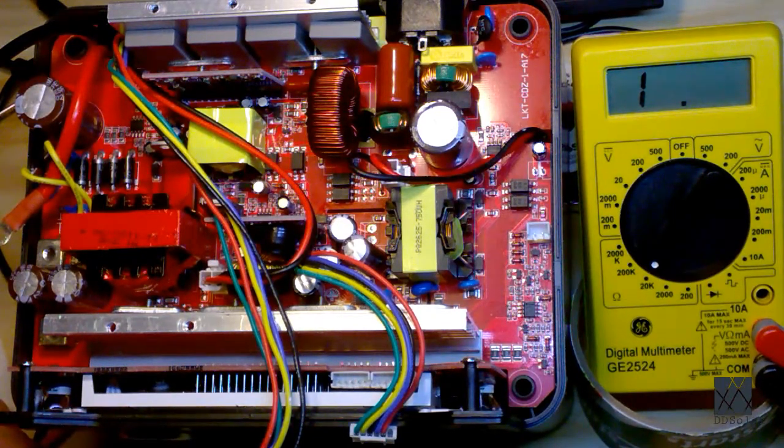So next I'm going to zoom into the left side where I found that fault and show you what I did to check. But before, I'm going to probe some other locations. Another place you can probe is the AC input. I'm not showing you, but the AC outlet, the 110 volt AC outlet. Be very careful doing this. Only do it if you know what you're doing. Probe across hot and neutral, which is the two main prongs on the outlet, and see if it's low impedance. If it is effectively an open circuit or high impedance, then it's probably okay.